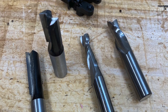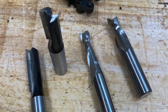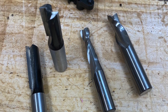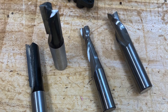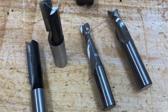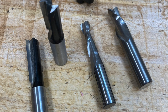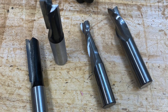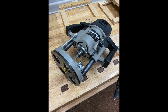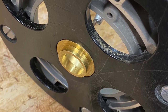An upcut spiral moves the chips upward. If you plunge it all the way through, it leaves a nice clean cut on the bottom but can leave a little burr or chipping on the top surface. Conversely, the downcut spiral on the right won't be very effective at removing material, but it leaves a nice clean cut surface at the top with no chipping. Any one of these bits would work for cutting these mortises. Anytime you're cutting a stepped mortise or making multiple passes to get the depth, a plunge router is the ideal tool. I absolutely love collars on routers — the versatility they provide is incredible.